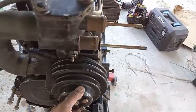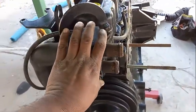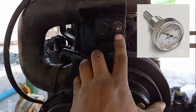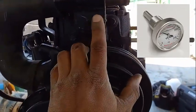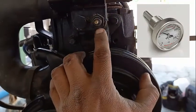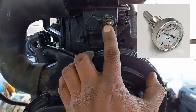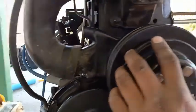Here's the thermostat housing. If the water temperature gauge doesn't work, we can actually put an analog gauge — a direct thread gauge right there — that will tell us the water temperature. We don't have all the gauges from the boat, so either we leave it with no gauges, which would be a pain, or we remove this and put an analog gauge to directly measure the temperature. Same thing applies for the oil pressure side.